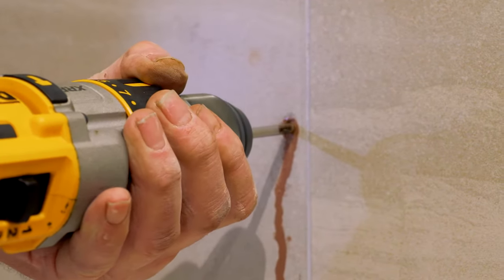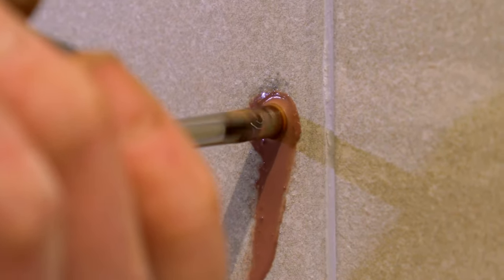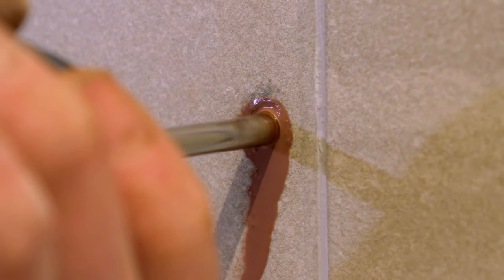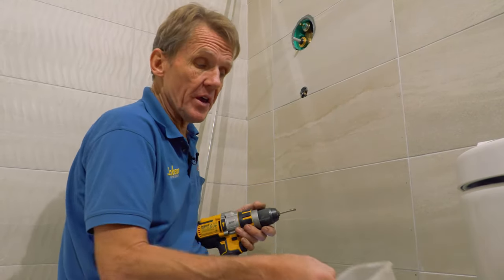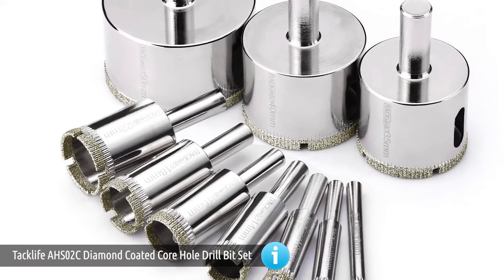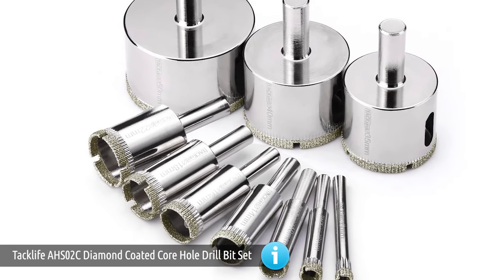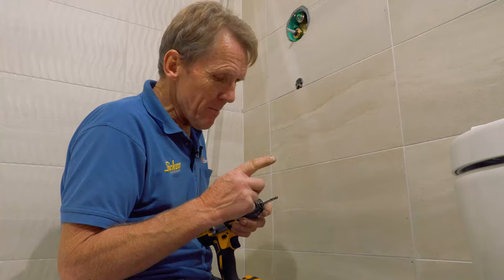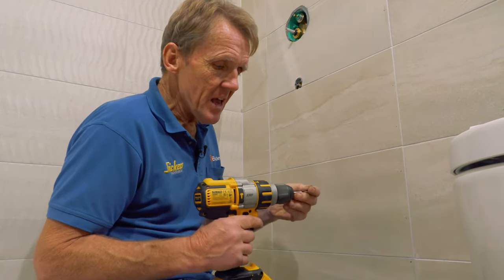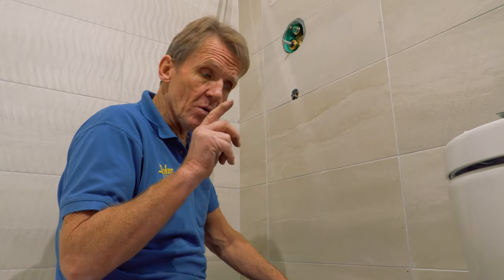Now, a lot of people quite rightly get worried about drilling tiles. Two things I can tell you. One is to use plenty of water and a diamond bit. Now, you might think diamond, that's expensive, but this whole kit that I got here, which includes 10 different sizes of diamond core bit, was around 10 quid on eBay. So we're going to put the link below for that. You can see that in our details. But also, the other thing is, it isn't necessarily the drilling. If you take it slowly, there's no reason why you should ever crack a tile when you're drilling.